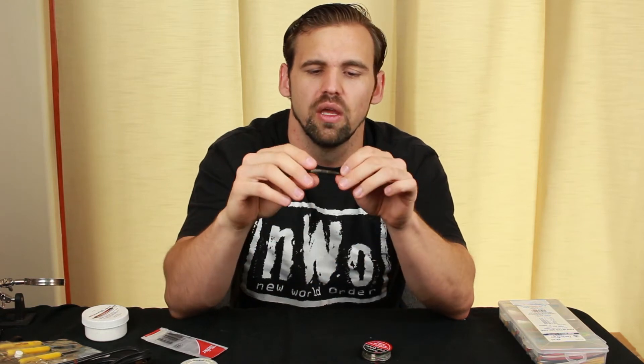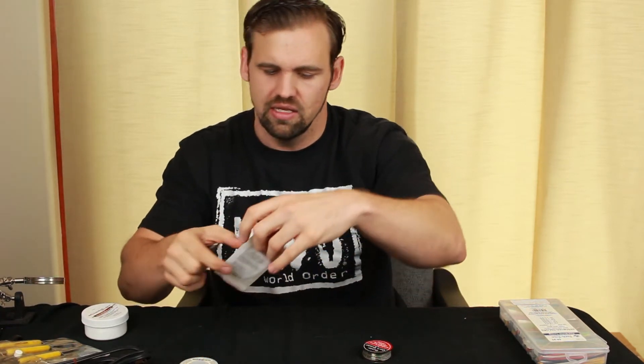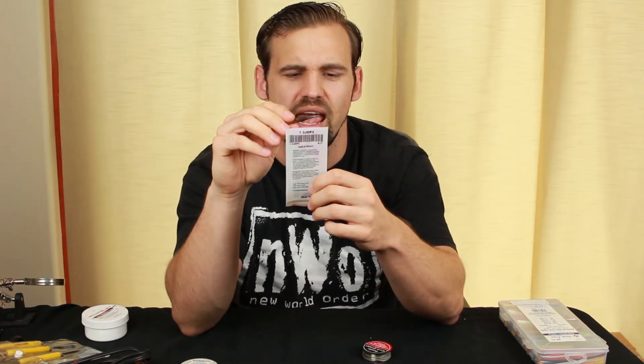One accessory a lot of people don't think about is soldering tips. If you're going to be doing a lot of soldering work involving both wires and PCBs, you'll want different style tips for different jobs. This tip right here is a conical one — made by Weller, the ST7 conical tip. Conical tips are great because they have a fine point at the end, making them excellent for small, delicate work like PCBs. The wedge tip that comes with my soldering iron is better suited for soldering wires.